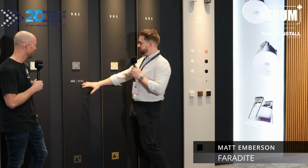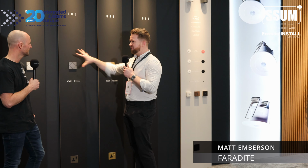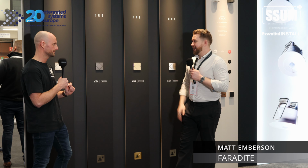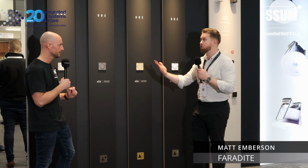The dry contact version aesthetically is mostly the same, but the halo light just responds to a press. The light just gives you an indication, and that's because it isn't clever enough to tell you what it needs to be. KNX is two-way comms. Volt-free is just saying the switch has been pressed, so go into Control 4 and do all the clever stuff in Control 4, for example.